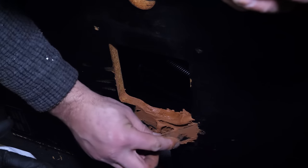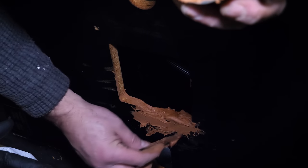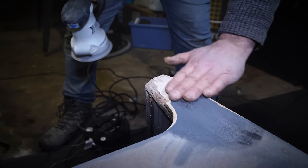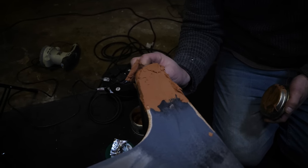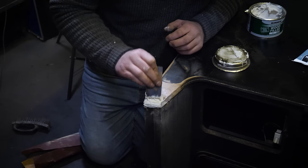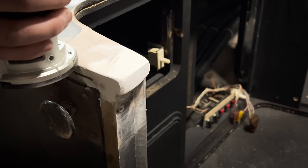While we're doing that, we also tackled the chunk missing out of the back of the machine. There should be a square vent hole and there's a bit snapped off of that, so we'll square that off too and we'll need to get a vent cover to go on that eventually. I have seen on my other Megatech cabinet that there are metal plates fitted to reinforce this part of the cabinet, so damage there must be quite common. Maybe we should consider metal plates in the long run. And then finally Alex routes the edges for that T-mold to lock into and hopefully at the end of it you'll never notice it was damaged.